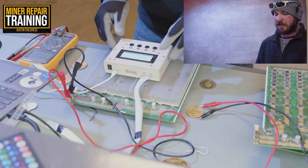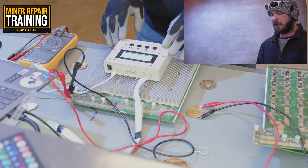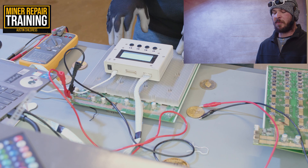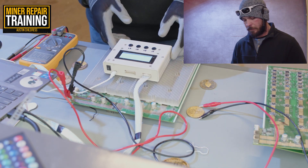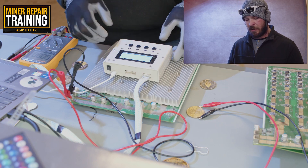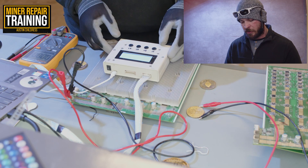As you can also see, it tests the RST signal by going backwards and forwards with that signal. This is mostly used for Whatsminer but it's also convenient for other models as well. Once you see you have all the ASICs, you can also use all these testers to touch-test all the different test points.